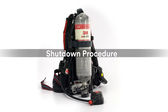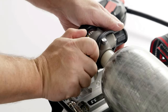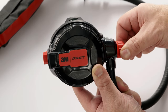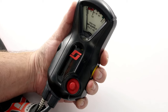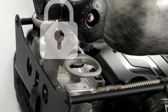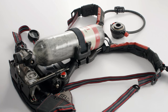To help preserve the battery life of your AirPak X3 Pro, it is important to shut the system down properly. First, close the cylinder valve handwheel by pushing in and rotating clockwise. Rotate the regulator purge knob counterclockwise to bleed the SCBA of remaining air. Turn off the electronics by pressing the yellow reset button twice. Then, remove the cylinder. On SCBA configured with a snap change connection, the cylinder latches cannot be pulled to disengage the cylinder until all the air pressure has been bled from the system.